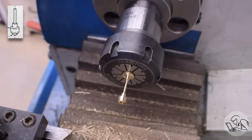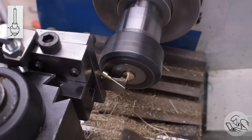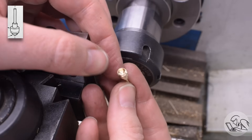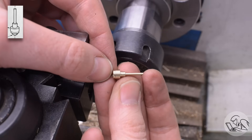Manufacturing-wise, that was probably the most difficult operation on this safety valve, but it seems to have gone well — so I'll part that off. That was close; I've had parts get caught in the chuck and mangled at the parting blade, but got lucky that time. That little valve plug is intact and looking good.